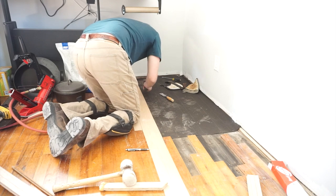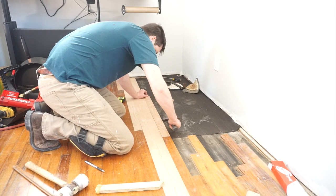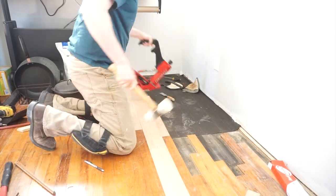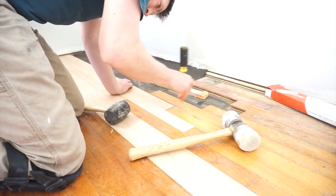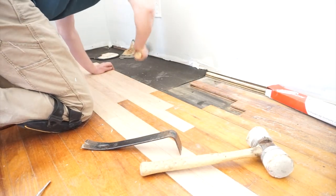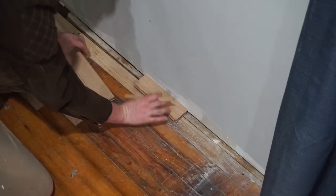There were a few gaps that were larger than others because of doing this. It's quite difficult to get absolute consistency when you're working with new flooring versus flooring installed over 70 years ago — and while that may be the case, it is still the best looking spot of flooring in the entire house. Because this flooring has been refinished before, there were some spaces filled with wood filler. I removed as much of the wood filler as I could to re-press the boards together and get a nice clean seam.